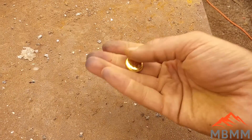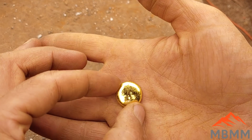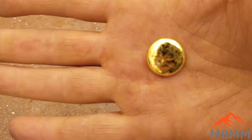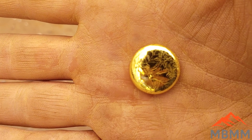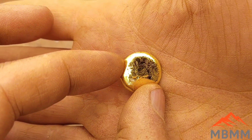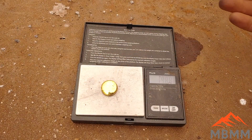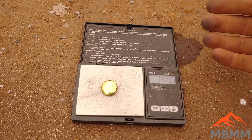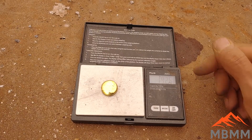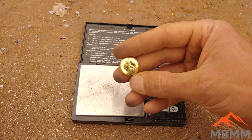Alright guys, here's our little gold button - it's pretty shiny yellow, so there's not a whole lot of silver in there, and it's got those kind of cooling lines on the surface. Not bad for a couple hours of running this morning. Let me get the scale out, we'll see how much it weighs. The stuff I panned out ends up weighing about 19 and a quarter grams, and those bags are somewhere probably around a ton and a half, maybe two tons. So we're somewhere in the range of 10 to 15 grams a ton with that stuff - and that's stuff I could pan out. Now let's go and smelt the stuff I panned out, and then we'll also smelt some number two and see how much precious metal we have in there.